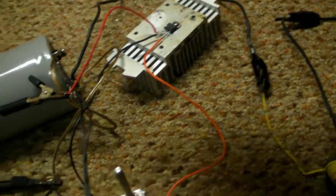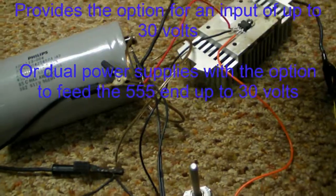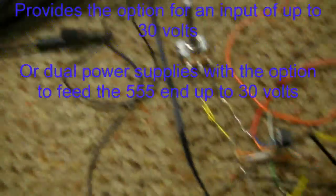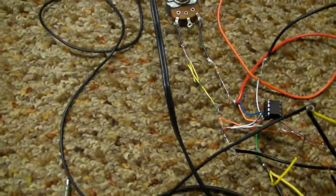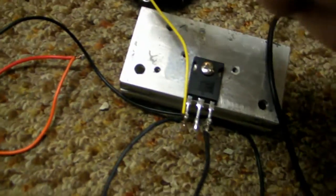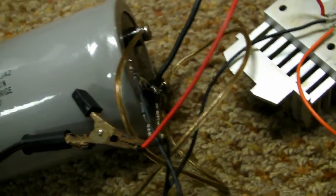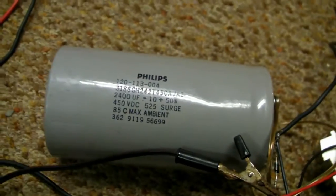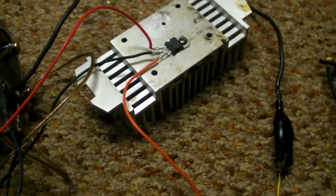What I'm doing now is having 12 volts run through my voltage regulator, which feeds the 555. The other 12 volt part goes straight to the MOSFET through the flyback, then goes to the jumper and straight to the other end there, with the big smoother capacitor being bypassed — so it's bypassing the voltage regulator.